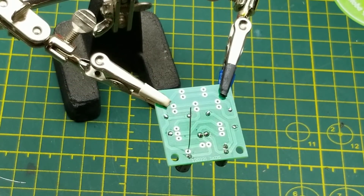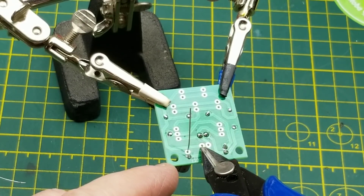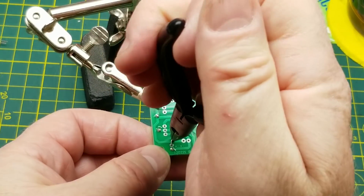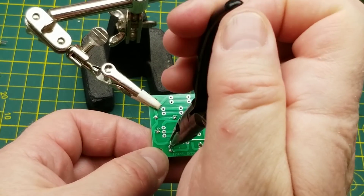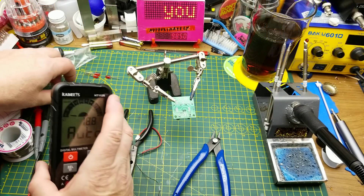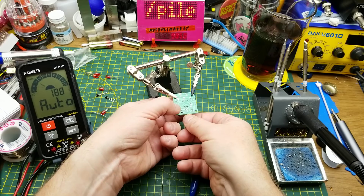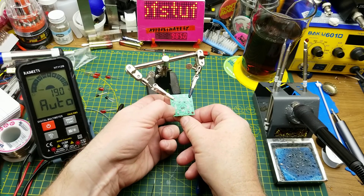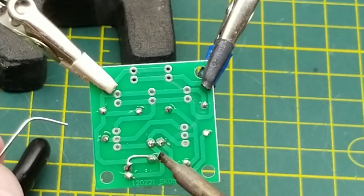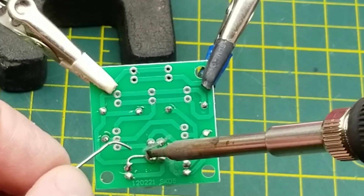What we do have to think about now is this little power supply filtering stability capacitor — where are we going to pick up that positive feed? I could just bend it over and tack it onto there — that might be the cleanest. Or I could scrub some of the solder resist off that track right there. I think I might do it that way, just to be neat and tidy. Which means I probably should find that power connector next and plug it in. I'll solder the capacitor down there just for mechanical stability.